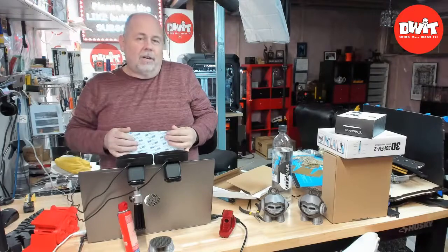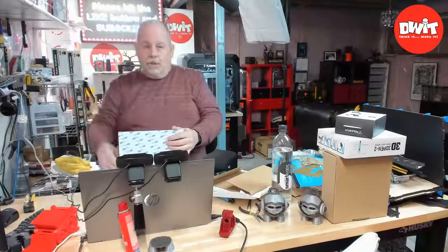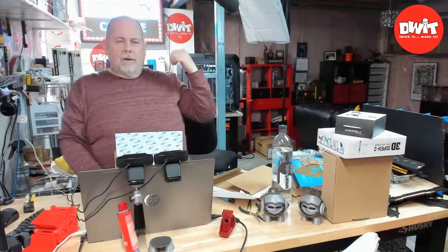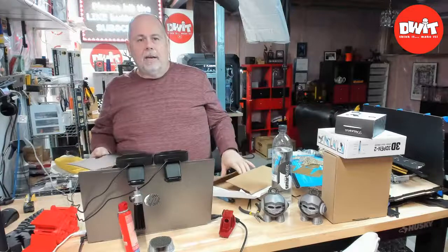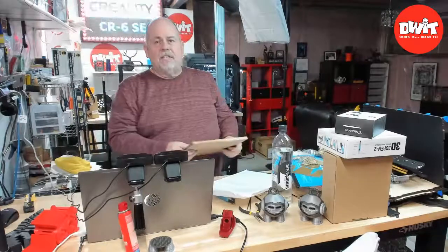Yeah, my Prusa is the same way as yours. That PEI sheet, I have issues, and a lot of people do have issues with PLA sticking to the textured sheet. But on that smooth PEI sheet, I have 3 of them over here. Don't know why I have 3, but yeah, IPA and a soft rag to clean them, and that's all they need. And everything sticks to those.